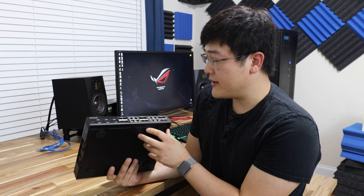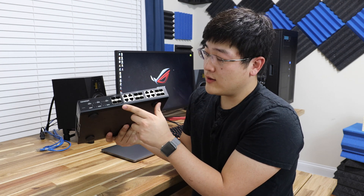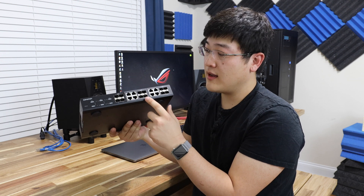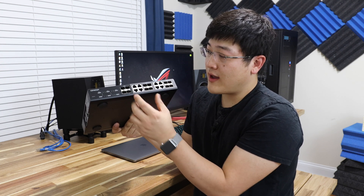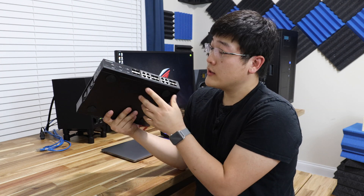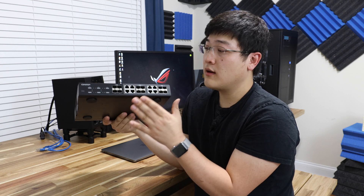The configuration is a little bit strange. You've got four connections for your SFP ports, and then you've got either four RJ45s or four SFP Plus ports. Meaning if you use port number 7, which is this RJ45 port here, it will disable this SFP Plus port right here. So effectively you've got four ports here, eight ports here but you can only use four, then another eight ports but you can only use four. For me, I'm really only interested in the RJ45s, so I've got basically all eight RJ45 ports that I can use, and they are all full duplex 10 gigabit ports with full bandwidth capability.